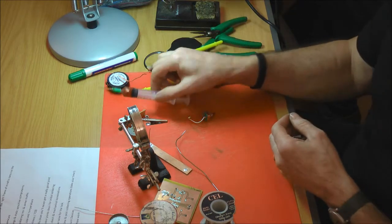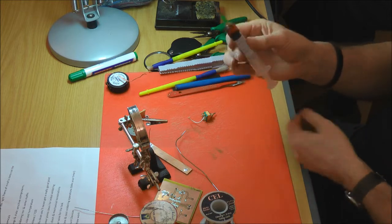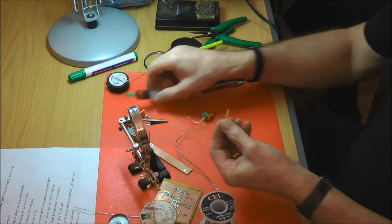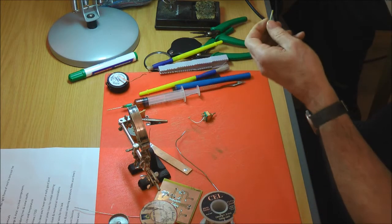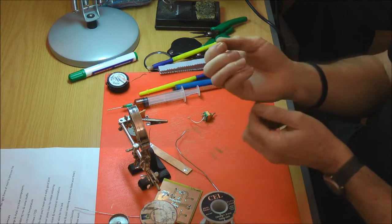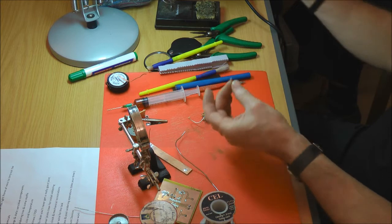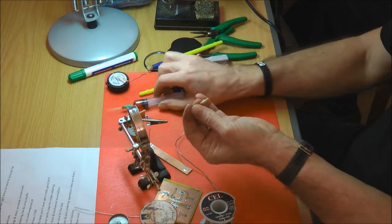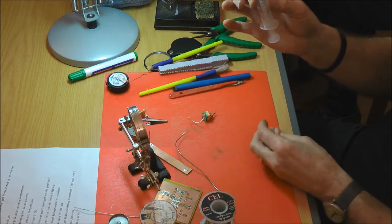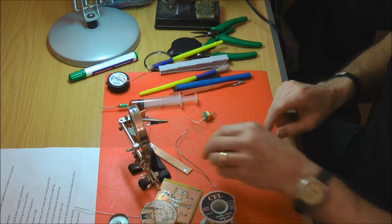So it stays in that hypodermic continuously, does it? It does. There's a highly technical thing. I've got to claim it's my own development, but when you get air dusters or the freezer sprays, they've got a little polythene tube. Chop it off. Don't use the tip, use the back end and melt the end over. Melt it so it's sealed, and then that keeps the tip from drying out. That's all that is. But that can last forever.